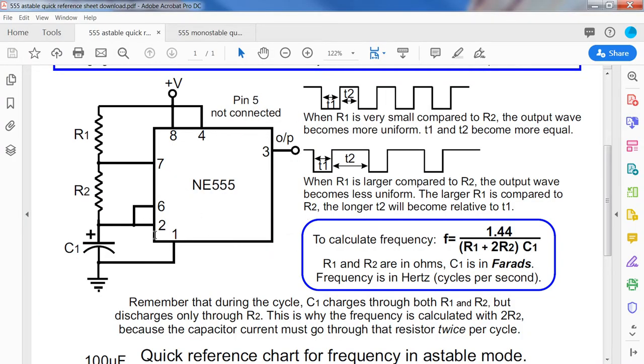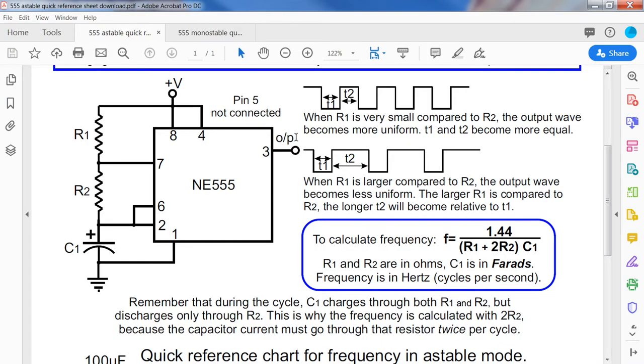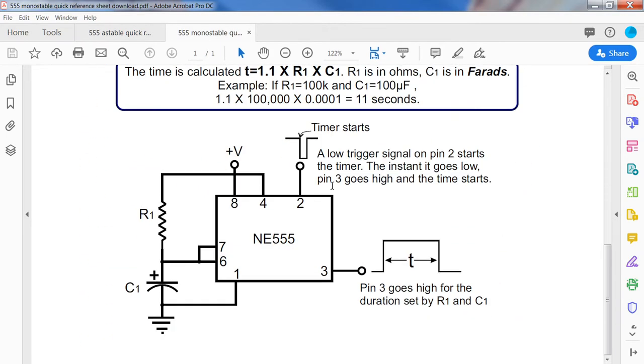It's expecting a pulse about every 50th of a second. So you can set up a circuit with two 555 timers. The first timer is in astable mode, so it's sending out a pulse train of around 50 Hz — the servos are very forgiving on this, your frequency could be way off and it will still work. The pin 3 output from this timer goes to pin 2 of the second timer which is set up in monostable mode. So every time it gets a pulse from the first timer, this timer chip sends out a pulse, but how long the pulse goes high is determined by R1 and C1, which you are replacing with your capacitive pressure sensor.